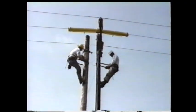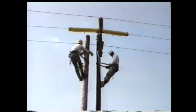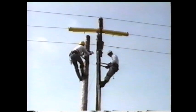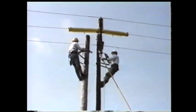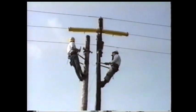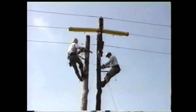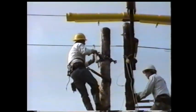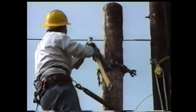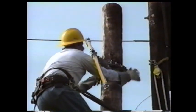After the cover-up equipment is applied, you can start installing the pole saddles. The top pole saddle will have a 1.5-inch pole clamp on it, and the bottom pole saddle will have a 2.5-inch pole clamp. After the pole saddles are installed, the 1.5-inch by 8-foot wire tong is placed on the conductor and tightened. The wire tong should be attached to the line from the bottom side of the line. This will ensure the line is resting securely in the C-head of the wire tong. The wire tong is then placed into the 1.5-inch pole clamp and the clamp is tightened.